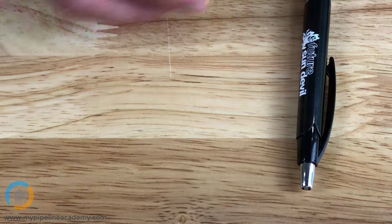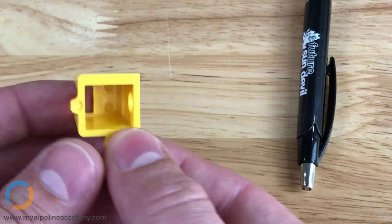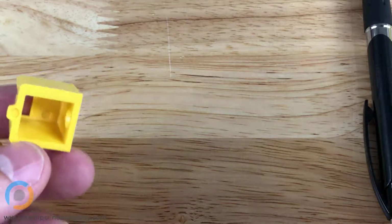That is what happens when you have thick volumes of material next to your nominal wall thickness. So what could manufacturers of this part have done to prevent that sink from forming? Well, what they would have done is make this wall thickness the same as the other three. So, right here, let's measure this.